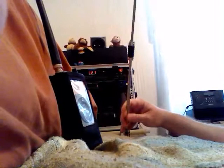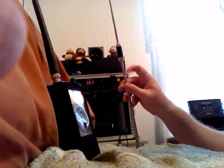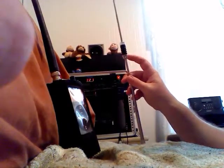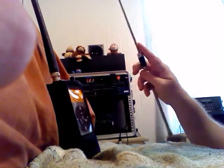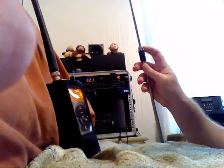Sorry about that, it's just hard to get this all in there at once. A friend gave this to me — he had a spare — and it's pretty tall when fully extended. This is a trap coil, and the instructions on these, I think you can still find them online, will tell you about the different lengths to use: shorter for the higher frequencies and extend it for lower. This trap, I believe it's like an FM trap, but it is a little tricky. If you short the coil — push it in just about a quarter of an inch into the top — it bypasses the coil and actually works better on certain frequencies, as I'll show you in a little bit.